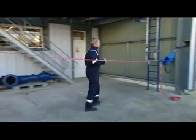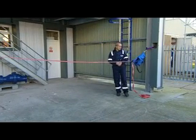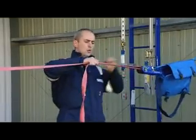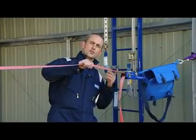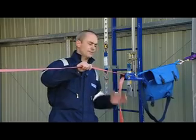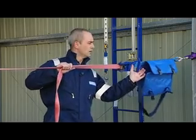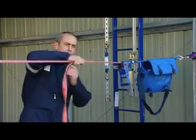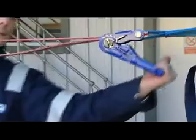Now we're going to tension up the horizontal safety line, because at the moment it's no good slack. This is where we use the ratchet. Pull as much slack through as possible, keeping the webbing parallel with each other — if you let it hang down it will cross-thread onto the spool, you won't get tension, and you'll probably damage your ratchet. Releasing the clip on the back of the handle brings the ratchet into play, and then tension up, keeping them parallel, until you've got the right tension.